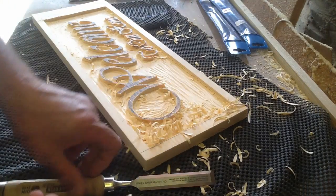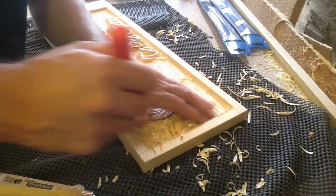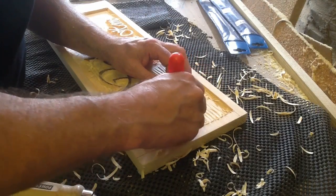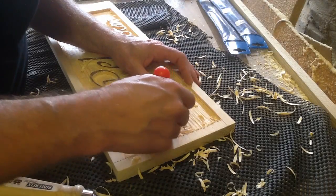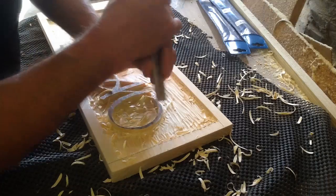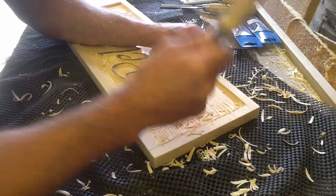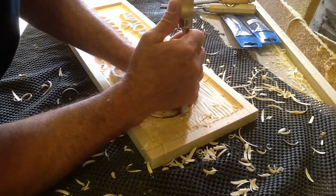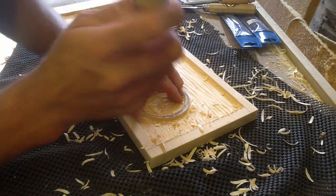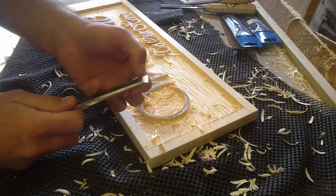When it comes to getting these little furry bits out, there are two things you can do: use a straight chisel or use a knife. To get to the edge, open the joint and they will come. A knife can be quite good because you can really follow the angle, but you can do the same with the chisel. I don't use the whole blade — I just use a corner. The chisel can be good because you can go a little bit deeper, but I just want to do a hair's thickness. Just keeping to the very corner of the chisel.